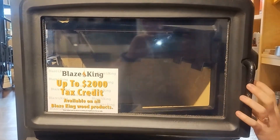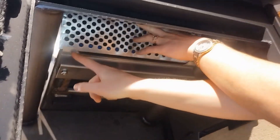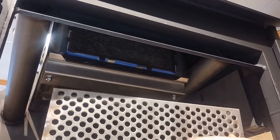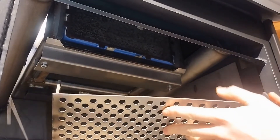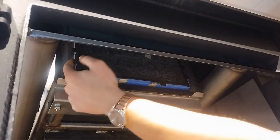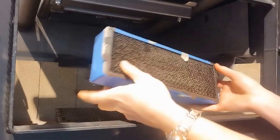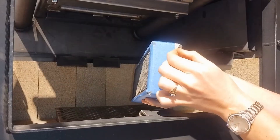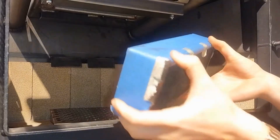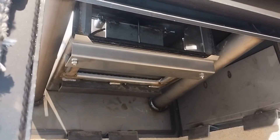Now we're going to check out the combustor. Inside the stove we have the flame shield, which just rests on two holders. The flame shield evenly distributes heat across the front of the combustor and protects the combustor from getting hit with debris. There we see our combustor — this is a metal combustor; some are made of ceramic. You can get a flat head screwdriver and pry around the edges to get it out, or push from the back if you have access through the flue collar. New combustors come pre-gasketed with tape — you leave the tape on when replacing with a brand new combustor. A replacement combustor gasket is also available if you just want to take your combustor out for cleaning.